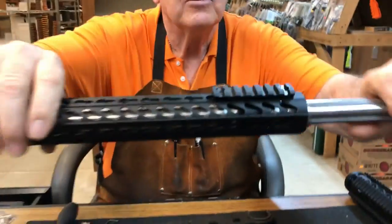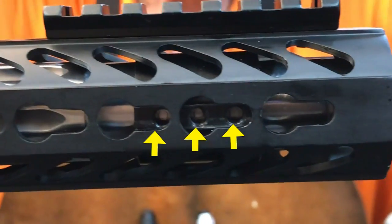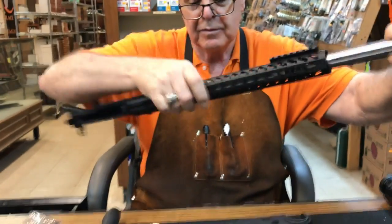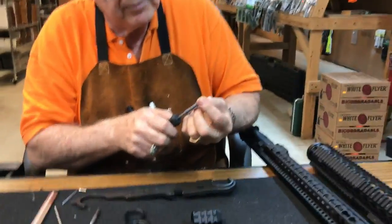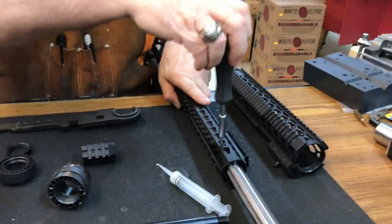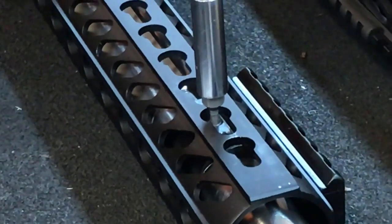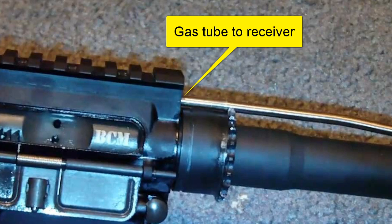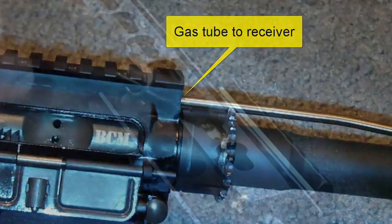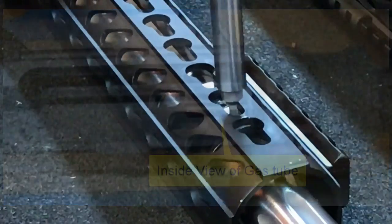The designers were pretty sharp — you can see three holes in the bottom of the gas block right there. They're tiny, but the holes line up perfectly so you can put the screws in after the forend is installed. Take an allen wrench — we've got three little set screws, probably 10-32 pitch. We know the gas block is in the proper position because we lined it up before driving it on; we already had the gas tube in the gas block so it went into the gas hole in the receiver like it's supposed to. These screws just make sure the gas block doesn't move.